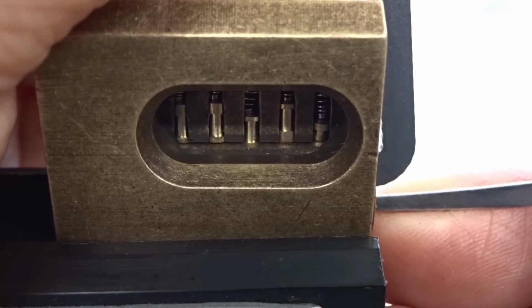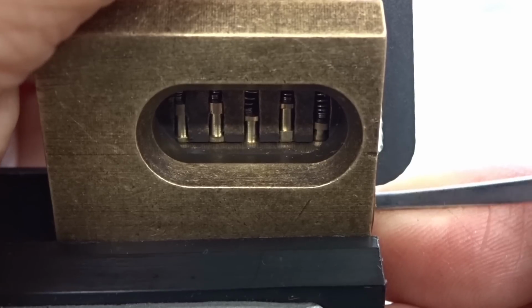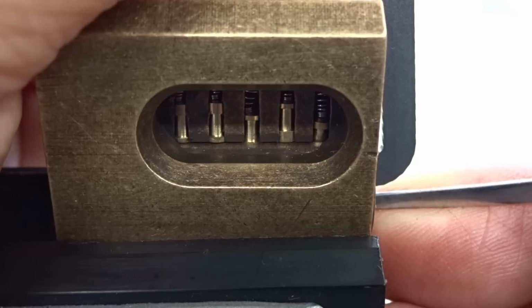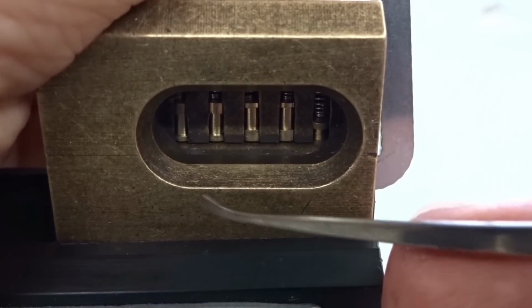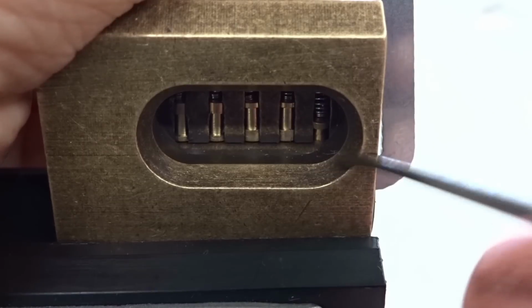he's not springy, except now I'm getting what's called counter rotation on my tensioner. That tells me he's a spool, and it also tells me that he's below the shear line. So I've got to release pressure on my tensioner and then push up. Well, now you'll notice, and again, if we didn't have the cutaway, we couldn't benefit from this. Everything's at the shear line except one guy.